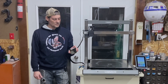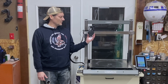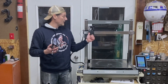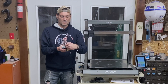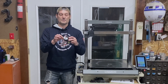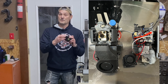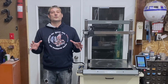Another thing we found is a very bad issue: the head assembly. We've gone through — this is our fourth head that we have on here. There is a small collar up below the heat sink, into the hot end and heater core. If that head clips at all, it breaks that super thin piece of metal and spews plastic out everywhere. The heads are literally unrecoverable after that — you cannot clean them out. They just gum up and it spews plastic up through the top and ruins the whole thing. But those are our two biggest cons.